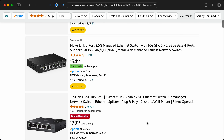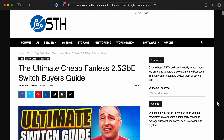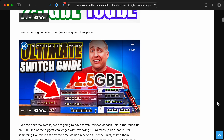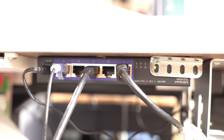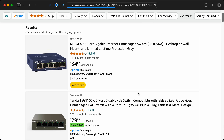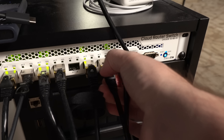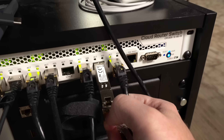Even if you don't go to 5 gigs, there are tons of 2.5 gig options out there. A guide from Serve the Home shows a ton of different cheap switches — most of them fanless, good performance, not too hot, and low power. That's a really good upgrade from 1 gig if you have a NAS on your network or want to transfer files or do screen sharing. So many devices now have 2.5 gigs, and it's so much faster. But 5 gig switches — or even 10 gig switches that support 5 gigabits — are still pretty rare. This is the first cheap adapter I found for it, and I really haven't found a switch I'd classify as cheap that does 5 gigabits natively. It's almost easier to find 10 gig gear and buy SFP plugs that work with 5 gigabits.